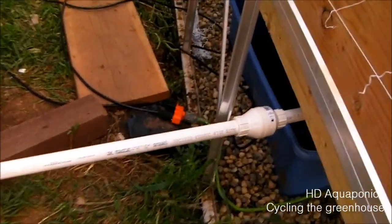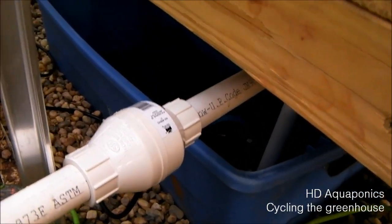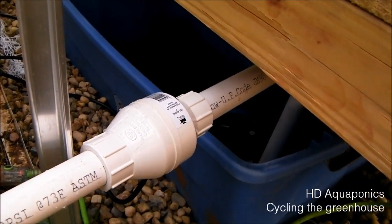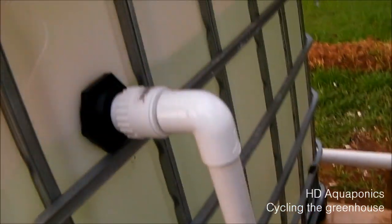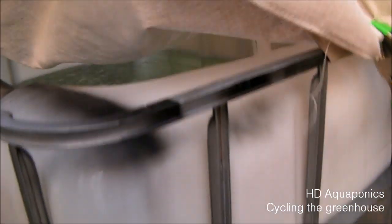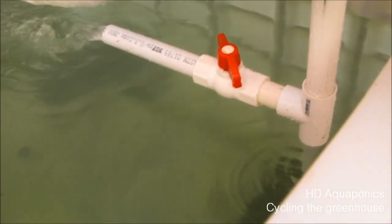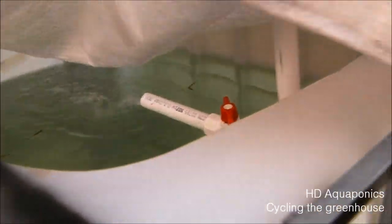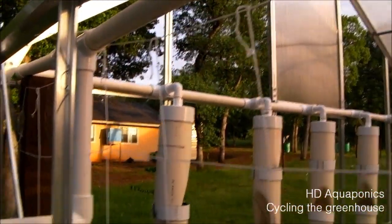Here's a line with a check valve that runs from the pump. When the level in the sump tank gets too high, the pump clicks on and pushes the water through this line and into a bulkhead adapter that's connected to the pump. And then on this side, just kind of the opposite, this is the recirc valve and the pump taking the water out of the connected fish tanks, up and over to the actual system itself.